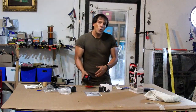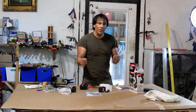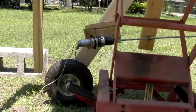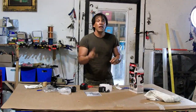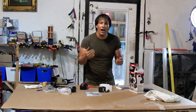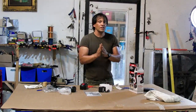So in this video, we made a solar tracker with a Fresnel lens on one axis that can track the sun throughout the day with manual adjustment. In a future video, I am going to be adding the heliotrack, which tracks the sunlight and tells the motors what to do. We're going to be adding the second axis instead of the wheel version like I had in the previous video, the prototype. We're going to be making a scissor lift that goes up. If you have linear actuators from old satellite dishes, they will work for this. Buying new ones, they cost anywhere from $75 to $105 and upwards. You need one with about a 24-inch draw, so they get kind of expensive.